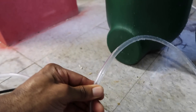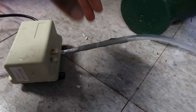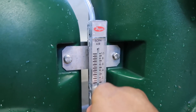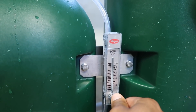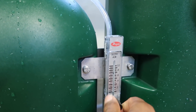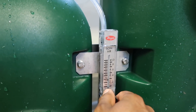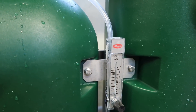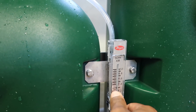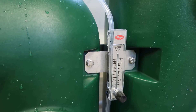And maybe this duct tape — I'm going to try it one more time with a thinner piece. All right, got it rigged up. Duct tape on it, and it looks like it sealed the hole — sealed it up all the way. So the pressure is a little bit more, and I'm going to have to close this valve down here to get it to where I want it to be at, which is going to be about — like I said, we'll start off at .3. I'm going to go look at the guidelines for the amount of air coming out, going through to the amount of times that it backwashes. There's a chart for that, so I'll look at that just to double check where I want it at. But right now I'll leave it at around .3.